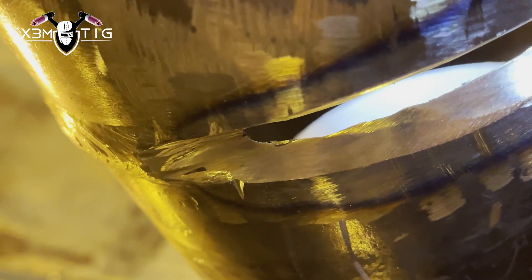That's it — we've got two passes on both sides. Don't worry about it, you're going to grind that later so it doesn't really matter. Just grab a grinder. As usual when you bevel your pipe, try to bevel both sides and keep a feather edge — or whatever kind of edge you like — so you can feed that 1/8 rod. I rebeveled it again. Pay attention to your start point and the angle when you start feeding that rod in. I like to keep my feather edge. It was nine mil and now my gauge is showing around five and a half mil, which is all right.